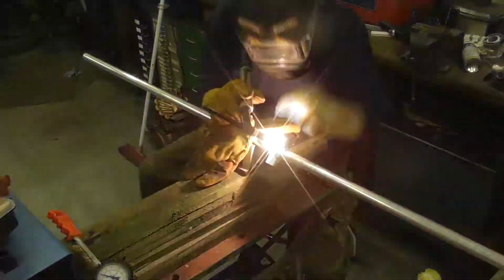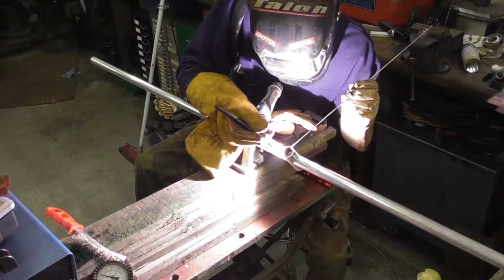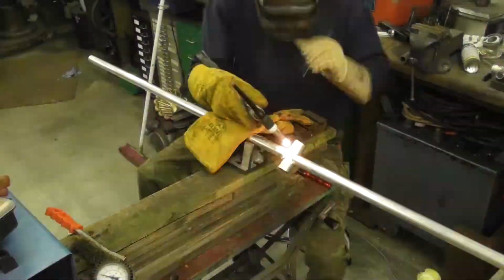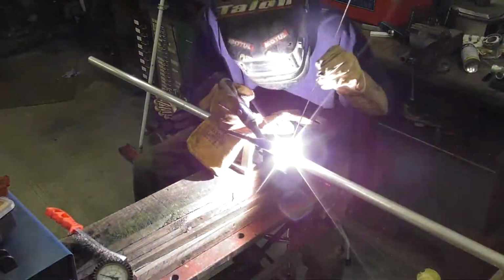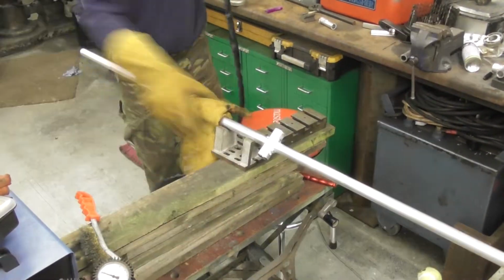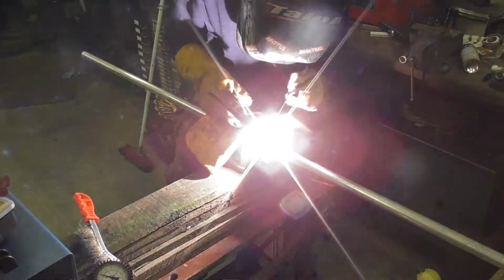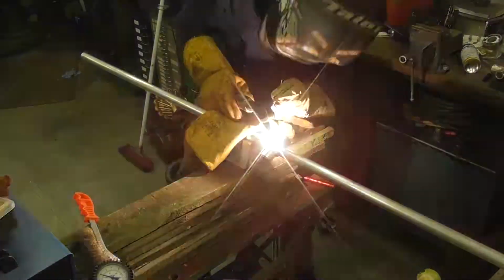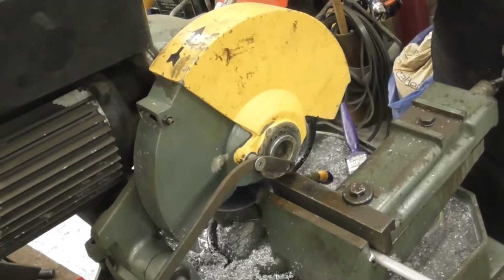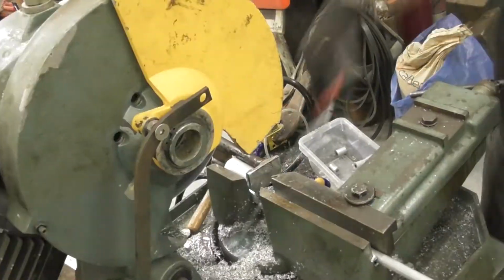And this is where I've got the majority of my TIG welding practice in there. You can see that giving them a nice good clean brushing up and wipe down with acetone in between each one. And again, we just left a set of the outer races in there to help stop the deformation quite a bit, with it being aluminium, which does tend to distort quite badly. That's all 10 done. Nice happy big thumbs up there, as you can imagine.